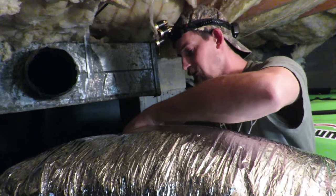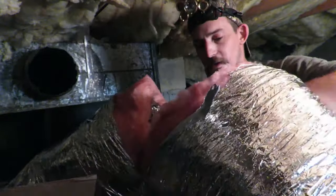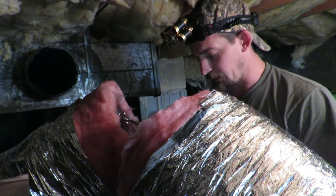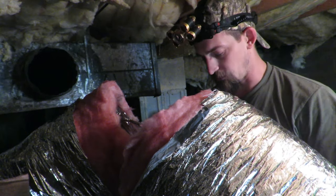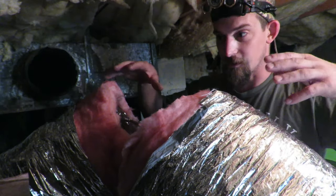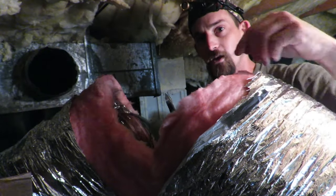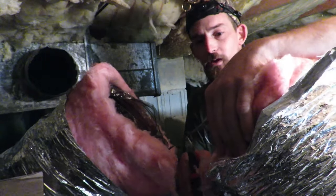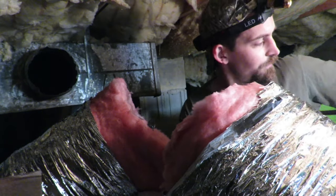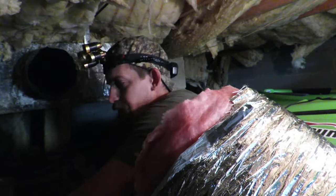Make sure you don't cut yourself. For PPE, probably some kind of mask or gloves if you'd like - you definitely don't want to be touching the insulation and rubbing it all over your face. After you get your flexible pipe cut, you're going to have a little wire here right in the middle, and that's where you take your diagonal cutters and just snip that off.